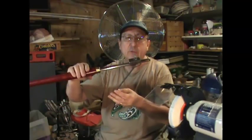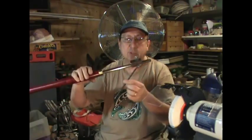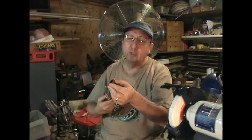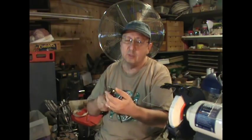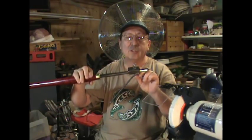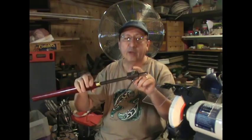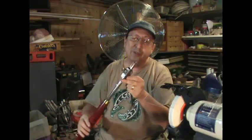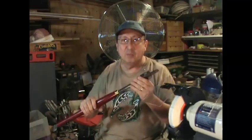So I decided I'm going to build a Captain Eddie style jig. Here's the jig I built. It's a piece of 5/16ths rod with a 1-inch square. The chisel sits inside the 1-inch square piece of metal. I welded a 5/16ths square nut on the top and a bolt through that, and I tapered it down like Captain Eddie showed. I want to show you how I built this jig.